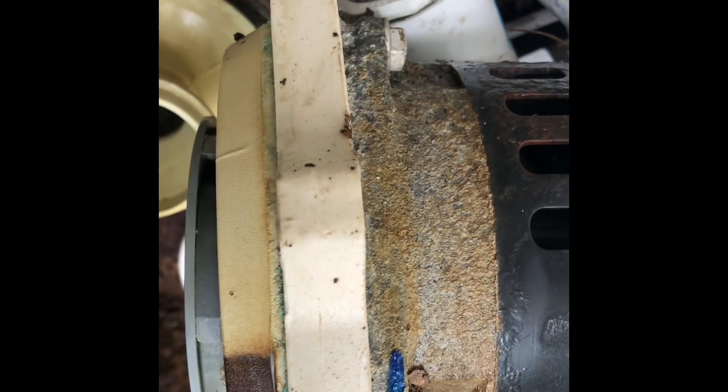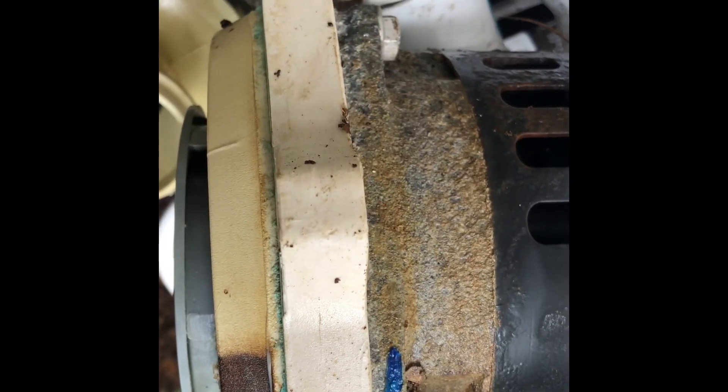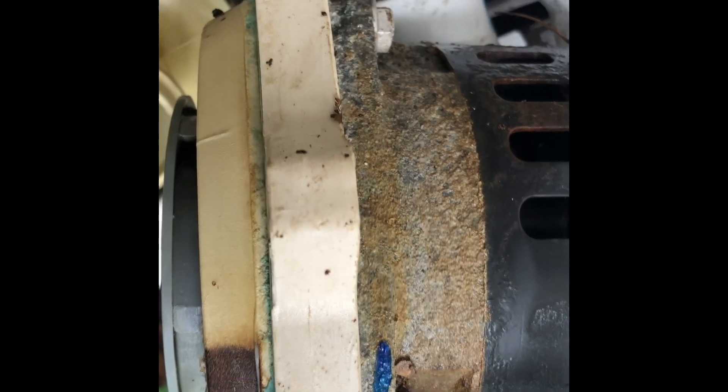The reason is, if you look at this housing where it mounts to the mounting bracket, the gap here is about three-eighths of an inch and the gap here is probably three-quarters. So what's happened is the seal plate has come loose from the bracket and it's pitched out now.